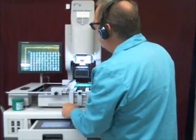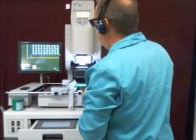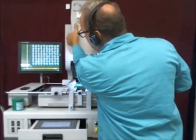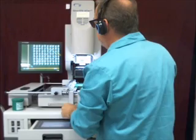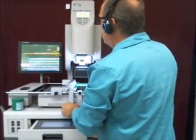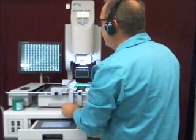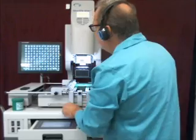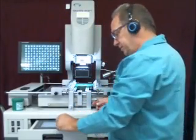Make sure that all the rows are on here. I've got my top solder balls here and I want to make sure they're all going down straight. Slightly off here, so we're just going to turn the rotation a bit. We adjust our micrometers and go back up. So they're straight at 100%. We'll go back to the center of the picture and line up our solder balls on our pads.